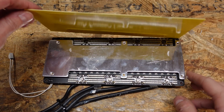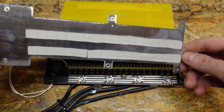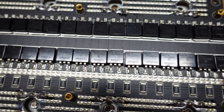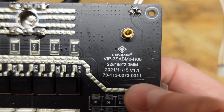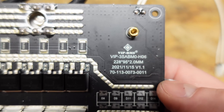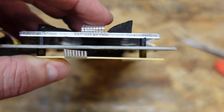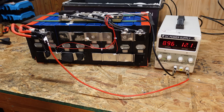Looking more closely at the BMS, there's a nice layer of epoxy board separating it from the battery. Removing the heat sink reveals a nice layer of thermal padding — I'm still not sure exactly what that material is, so if any of you know, please let me know. There are a lot of FET transistors visible. The part numbers are readable on screen. This is confirmed to be a VIP brand BMS, built November 15, 2021. On the other side of the BMS there is a second thermal switch, with leads routing straight up through the center of the FET transistors — so we have one thermal protection switch on the battery and one on the BMS.